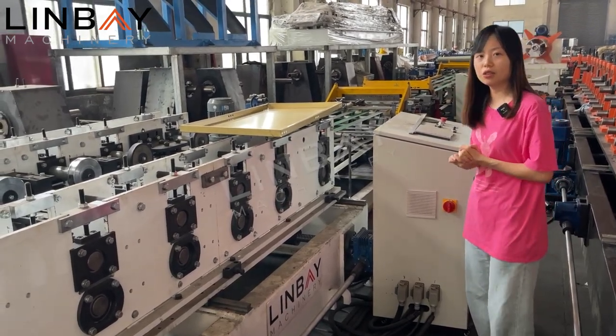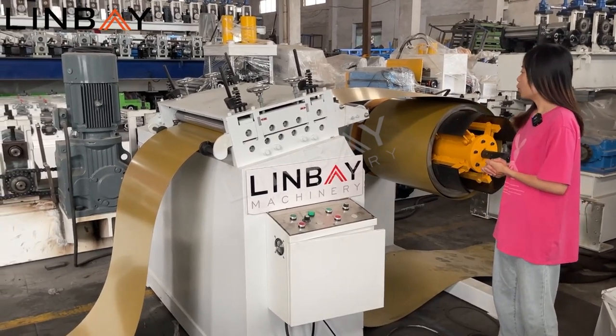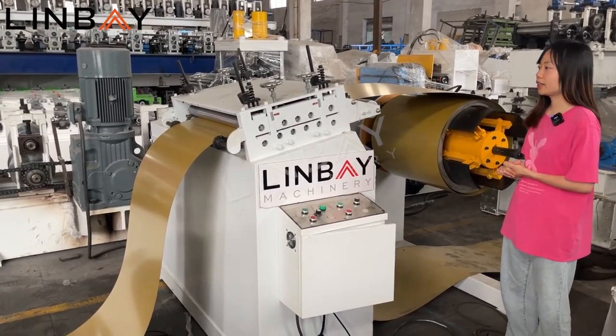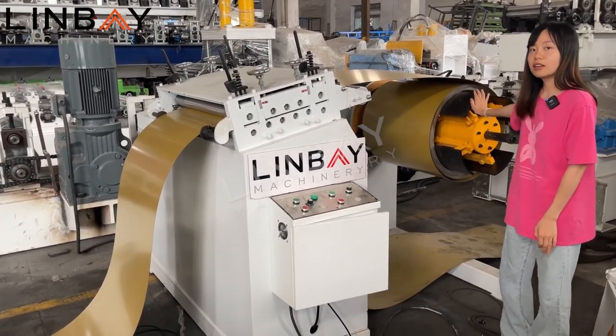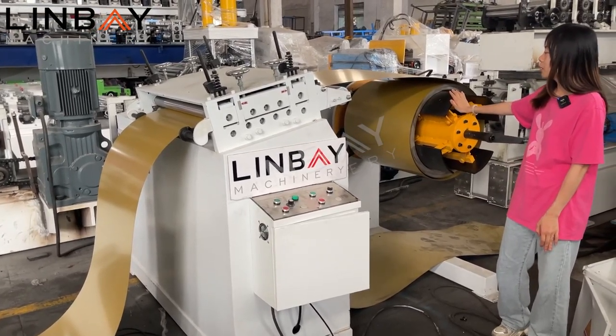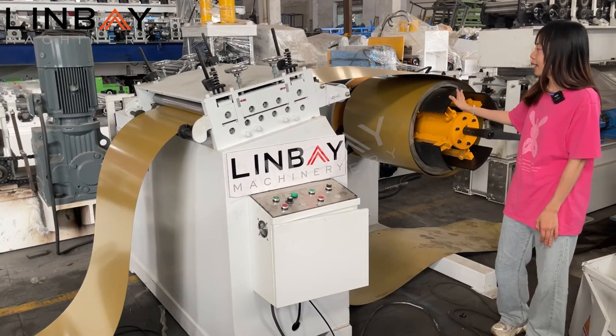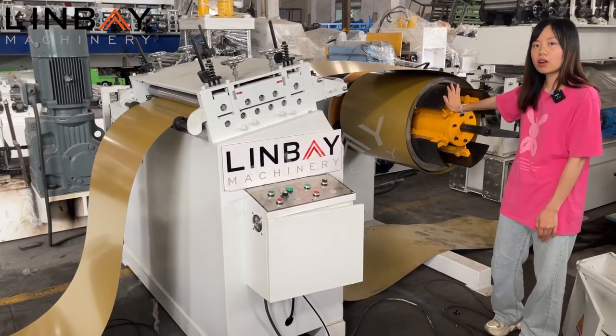Okay, now let's take a look at it. For each production line, we will start with an uncoiler. And here we adopt a 5-ton hydraulic decoiler. The biggest advantage of a hydraulic decoiler is it can keep the machine working smoothly and steadily. Also, it can help us to save manpower costs.